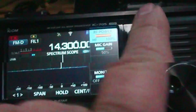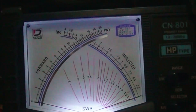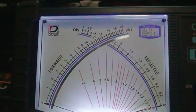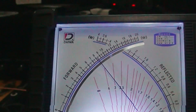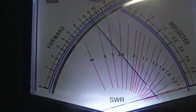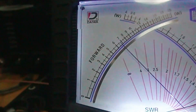Looking at the radio — RF power is at 100%, because we're hooked up to the power supply. I'm on FM at full power, which should be around 10 watts, though this radio doesn't quite hit 10 on my meter. On FM it shows about eight and a half watts. Switching to SSB and putting a whistle into it — into a dummy load — we get about nine watts. That's what this radio puts out according to this meter.